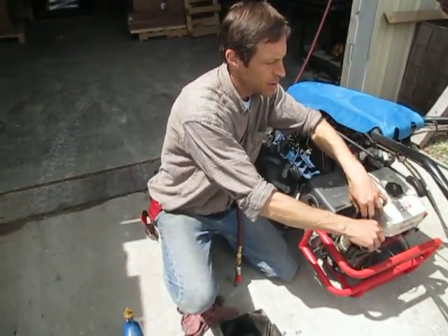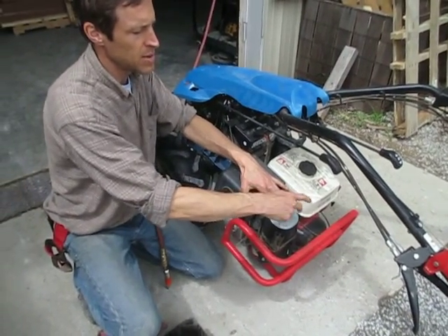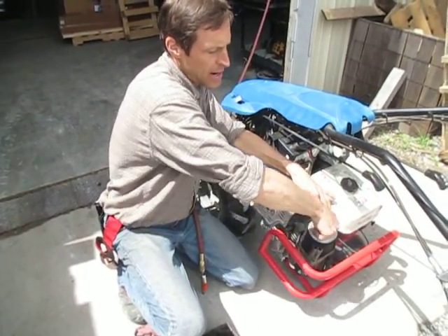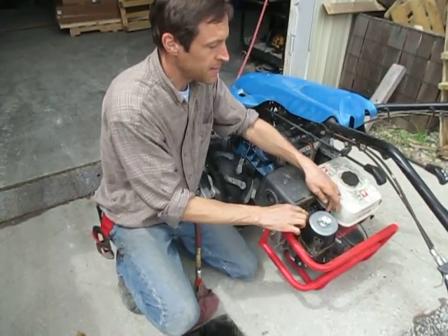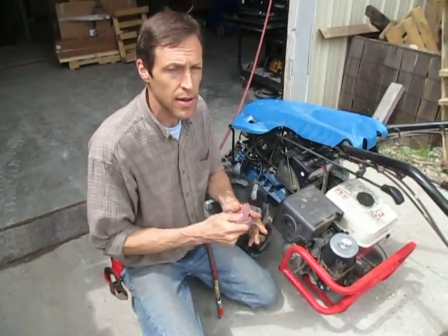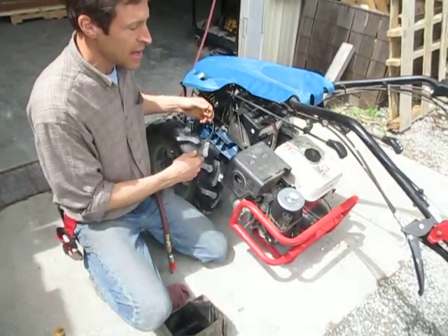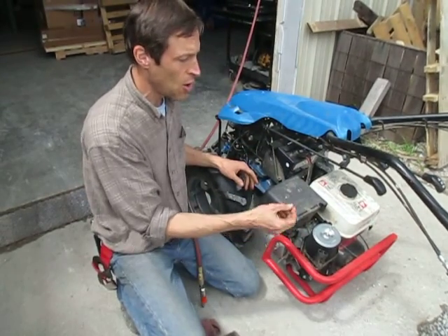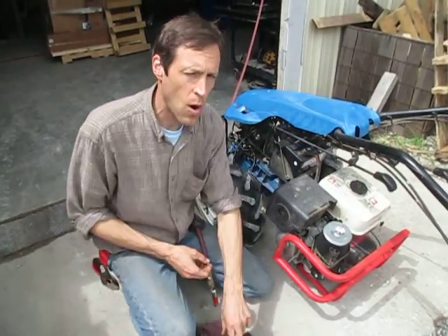So put this all back together. Some air filters, like on some diesel engines, don't have a foam pre-cleaner, so you don't have to worry about that — but you still need to do filter maintenance by knocking them out and blowing from a distance with an air compressor. In high dust environments or when doing a lot of rotary mowing, it's not uncommon to clean the filter a dozen times a year. Cleaning can just mean sliding the foam pre-filter off and knocking it on something. As long as the inside of the foam still looks clean and still has some tackiness, put it back on and run it — but if it feels dry, wash it out and re-oil it.